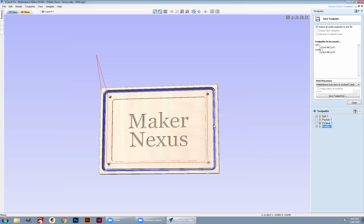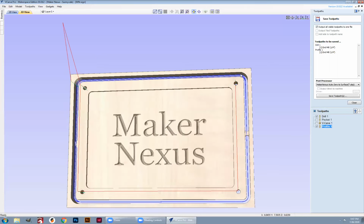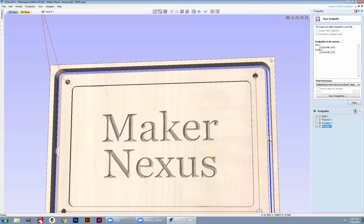I'd copy all three of these files to my flash drive, take it to the machine, and I will attach my 12x9 piece of material. I'm going to put the screws in the very far corners and trust that the tool will not touch them. I could also start with a larger piece of material, that might be another plan. But I'm going to go with the conservative view and feel that I can get the fasteners in the corners, and all will be good.